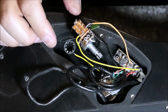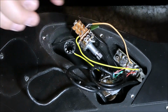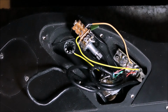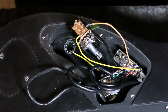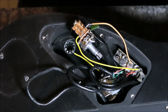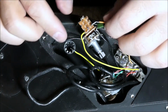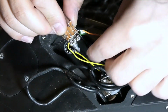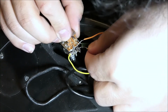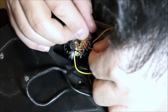The next thing we're gonna do, the last thing probably, is connecting this output to these ones in the middle, these pins in the middle. So let's go ahead and do that. So since we want to connect both of these pins to both of these pins on the top, the middle ones, the good approach is to, instead of connecting this to both of this, it's better to connect these two pins in the middle and then connect this one to only one of them. So let's see what we can do here. Oh, well, I can connect the wire to both of these pins, so that's what I'm gonna do.